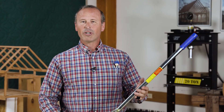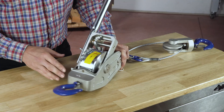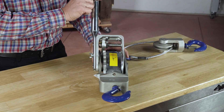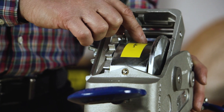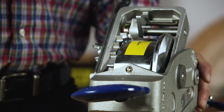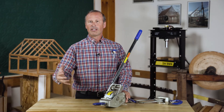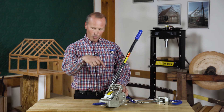If you've never used one of these, they can be a little bit confusing the first time you put your hands on it. There is a toothed wheel on the side, and this handle is actually moving that toothed wheel, which is attached to the drum. As you pivot the handle back and forth and ratchet against this wheel, you're drawing the cable in and moving a load from point A closer to point B.